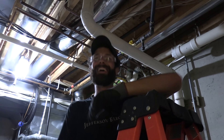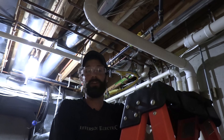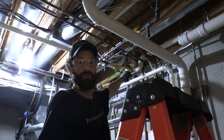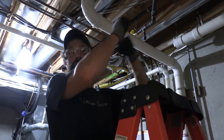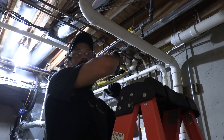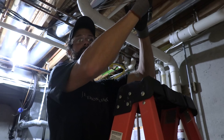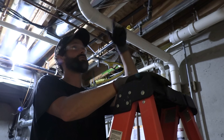We're going to pull the control wires and the feeders. Bruce is up top in the garage, which is right through a hole over there, and then Tom is going to be in the basement. I'm going to relay here in the middle, and we're going to try to just feed it through nice and smooth. We'll have a rhythm of about as far as your arm can reach — about three to four feet — and we'll just do that together in nice, steady unison.